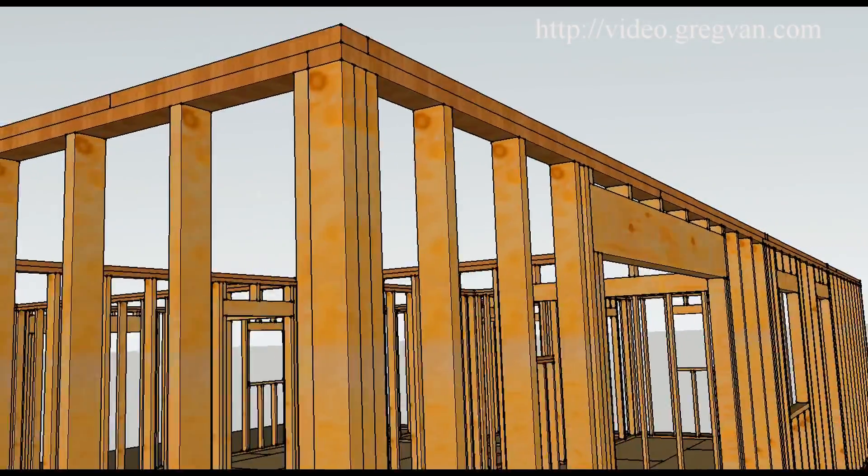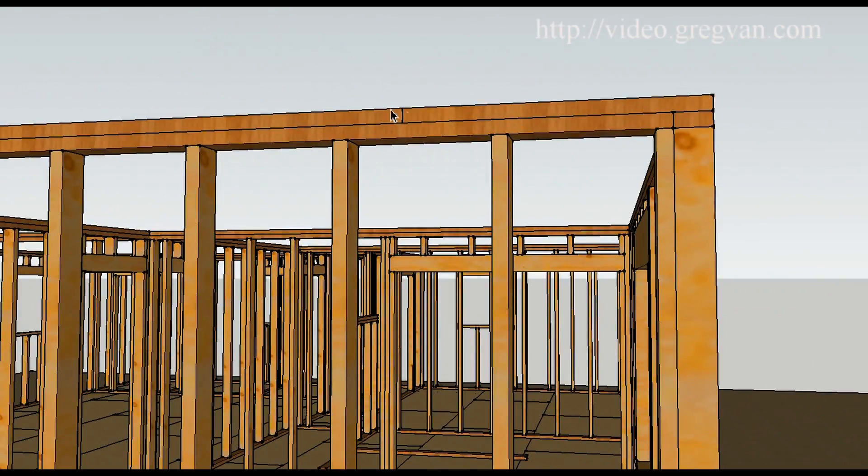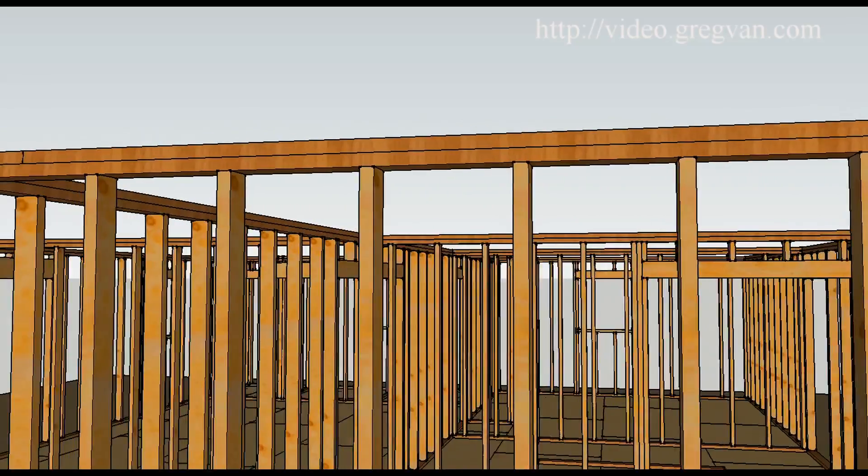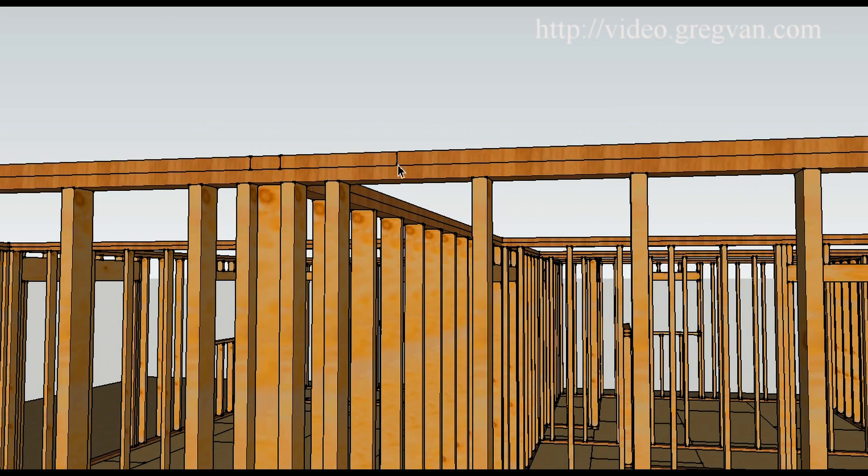Let's turn the corner here. A break here at the top — yes, this would definitely require a strap. All you would need to do to fix this is make sure that this plate is at least four feet long. Next, we have a break here, and as long as this plate is continuous and not within 48 inches of another break, this isn't going to be a problem.